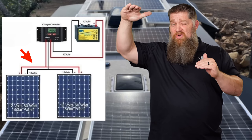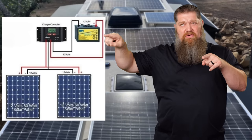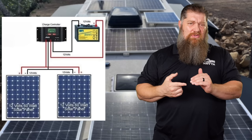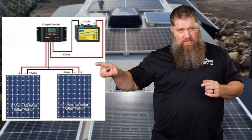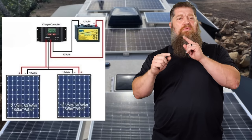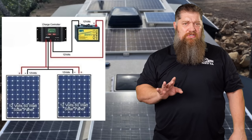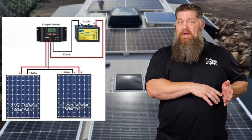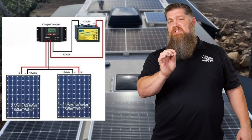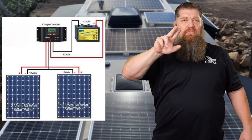You need to check polarity in both locations: between the solar panel and the solar controller, and after the solar controller going to the battery. If reverse polarity is coming into the solar controller, chances are you've already fried it. Hopefully it was fast enough to protect itself. If the reversed wires were going directly to the battery, you've already let the magic smoke out — the battery will instantly fry the solar controller. So if your system is showing a reverse polarity code, check the wires from the solar panel to the solar controller first.